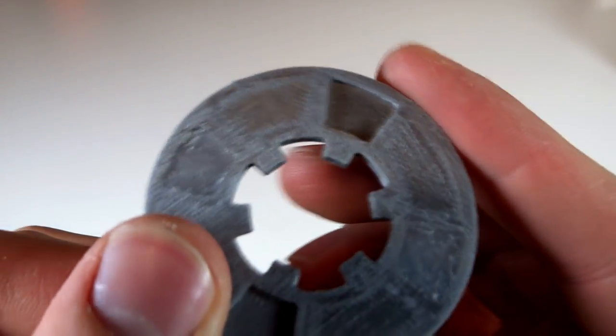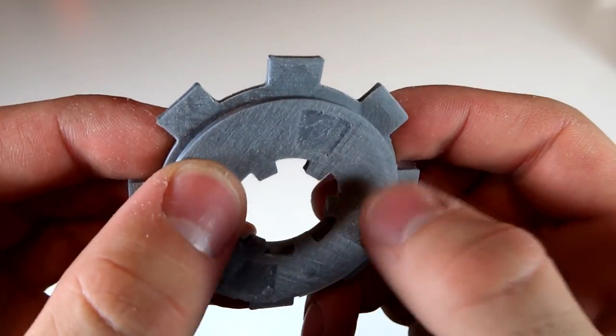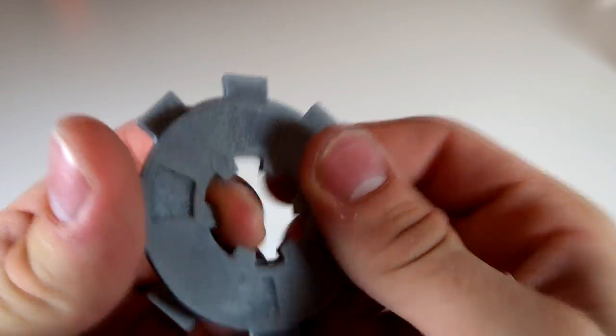As part of a solution, what I'm gonna do is add two patches of hot glue to each of the friction discs. You can see there's the hot glue that I've added to it, and I've kind of faced them off to be even. There's enough that when there's not very much contact it slips just fine, but when you start adding pressure you can definitely feel that there's a lot more grip coming from the hot glue, so it does work under pressure.